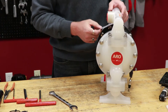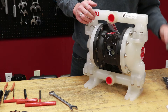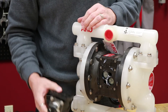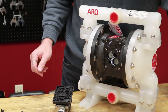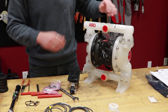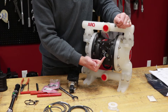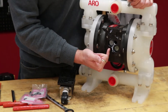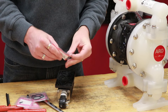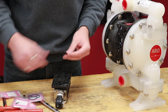The next step is to go back to the other side of the pump. We are going to install the new major valve assembly, which will include your solenoid. Each conversion kit comes with all of the proper seals. Make sure you save and keep your two quick dump valves from your original major valve. Go ahead and properly lubricate all of your seals with FML2 grease.